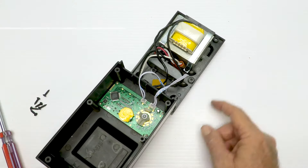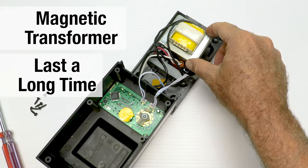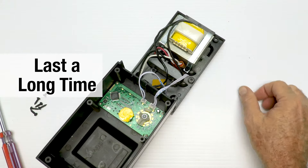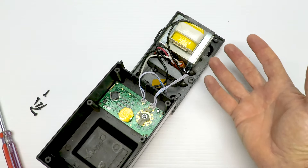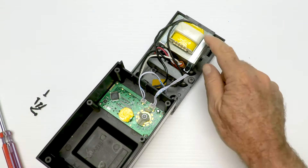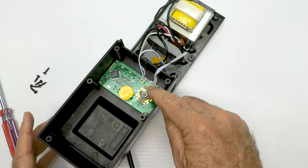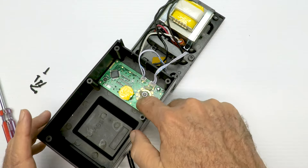Here's the magnetic transformer. We like magnetic transformers because in the landscaping world they last a long time, as long as they're protected in a good case and bugs don't get in — they're just reliable transformers and we always like that. The wiring goes up here to the circuit board, which is what you see on the front, and there's no problem there.